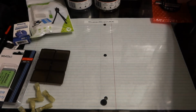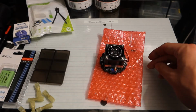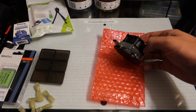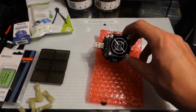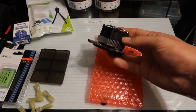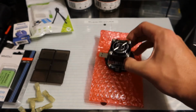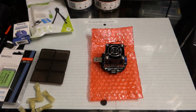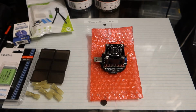So next thing is a USB dummy load. It's got Type A on the input, micro B there, and Type C here. The only thing I don't like is it doesn't have any pass-through on it, but it's got a little potentiometer, and it actually uses an IRFP260, which I had a bunch of, but I used them all. But you guys will definitely know that from all the ZVS drivers that me and all the other guys have made.